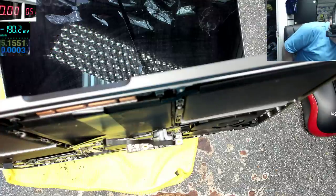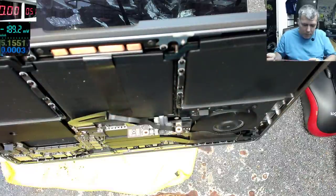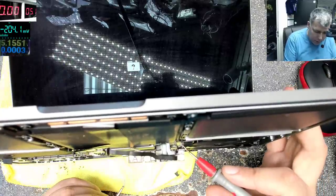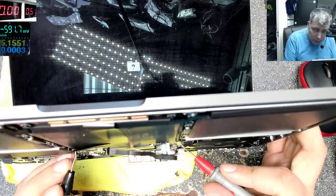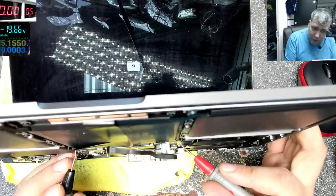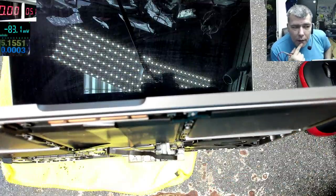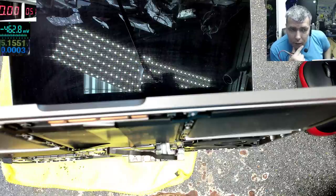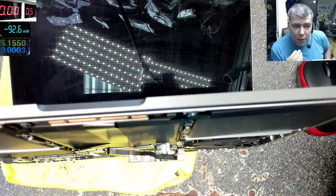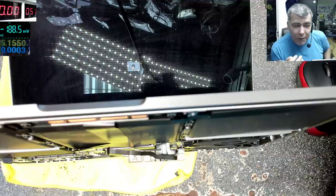Yeah, Jason is happy. We have the folder sign on the screen. Let me check one more time with this multimeter. On that point, yeah, the laptop is on. We have the folder sign. We have 19 volts, from where I took that capacitor out and didn't replace it. Which is fantastic. So if we have 19, how did that capacitor die if it is rated for 35 volts? Poor quality, you know, poor quality.